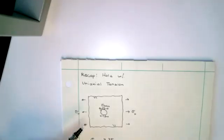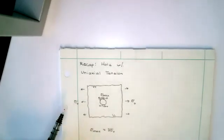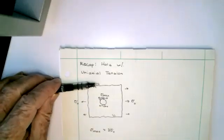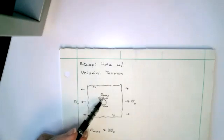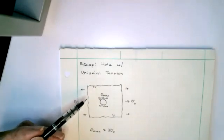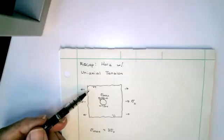And I told you, if you want to try and get a feel for stress concentrations, then you can think of a flow of people coming down here. If the people are way up here, they don't even see this. The hole then becomes like a big rigid tank or something like that, something that blocks flow, in this analogy. Mathematically, this analogy would be called a harmonic problem.